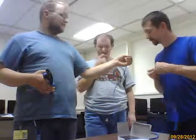Same thing on the other side. Yes, sir. Something wrong with it? Taking a lot of pressure. Did you get the connector all the way up into the connector? Yeah, I think it's the shielding in there, because you see the Kevlar? I think I got some of that. That wasn't supposed to be crimped. If you got it crimped good, it should be good to go. And it also could be that that gear in there might be just a little bit tight.